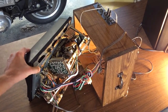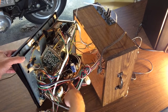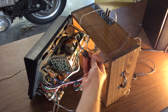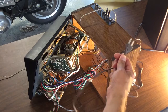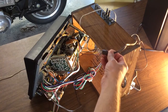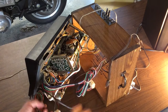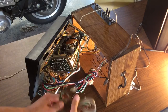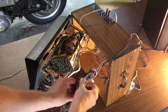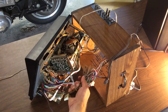This is the back side of the unit. This is mainly the 8-track tape section up here — the mechanical parts. The tuner is down here, the AM-FM tuner on the board. This wiring comes from a transformer. The AC power already had a long cord on it with the plug on the end, so I didn't have to rewire anything. It had a spot inside the TV to plug this into — a separate outlet — so all this was plug and play. You could just probably take this out to service it if you needed to, just by unplugging everything. This came from the TV board — the TV sound — and this went to the phonograph section turntable, so I probably won't be needing these, but I'll just bundle them up and find a place inside here for them.